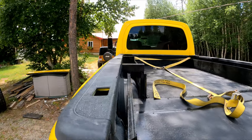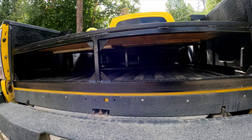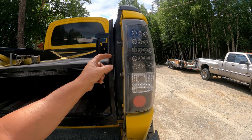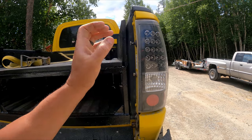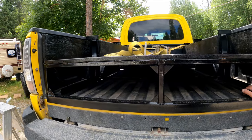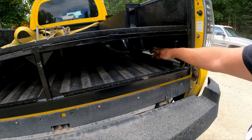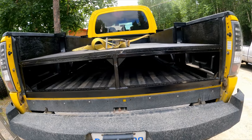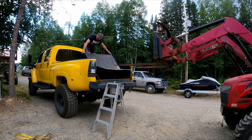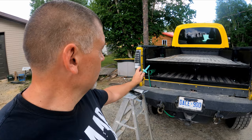We've got our side box supports just a tiny bit above the edge of the bed with storage underneath. I'm going to add a hole into the box and put a nutsert in so I can bolt into it to support the box sides. Then we can bolt the sucker down — four half-inch bolts go down through, one hole on each side at the back and one at each side at the front. Spacers in, rubber mats in, bolted down, wires run for the lights.